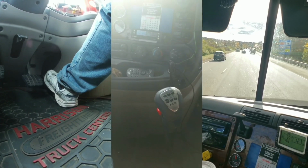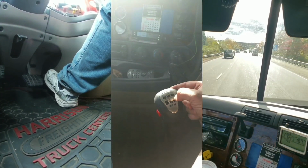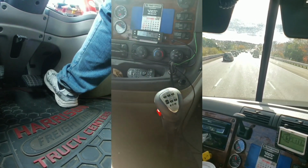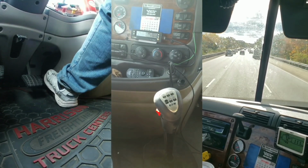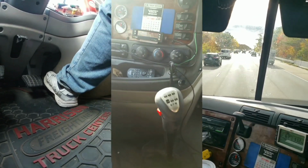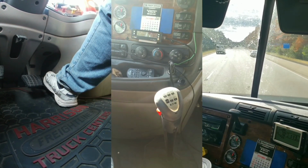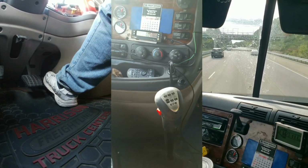So about 1400 RPM with a 0.73 to 1 gear ratio on the high side for the double overdrive, because there's 2 overdrive gears, a 0.86 to 1 and a 0.73 to 1. Whereas 7 high or 11 is 1 to 1. So direct, single, double over. So 1400 RPM with a 0.73 to 1 overdrive with a 3.42 to 1 gear ratio in the rear ends with a 39.5 inch tall tire. Anyone know what speed that is? Alright, that would be 65 miles per hour. I'm sure there might be 1 or 2 RPM off, but basically 1400 RPM is 65 miles per hour.